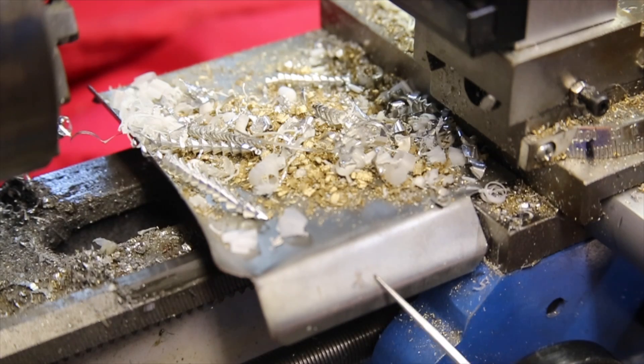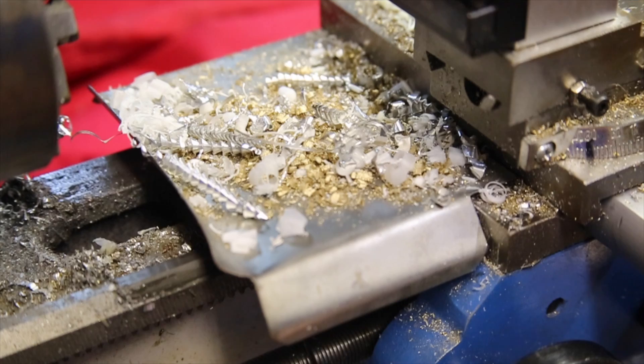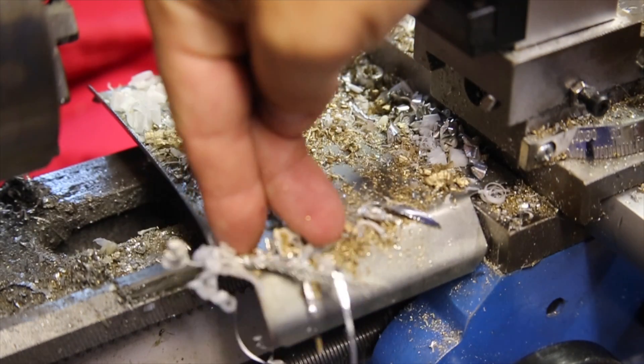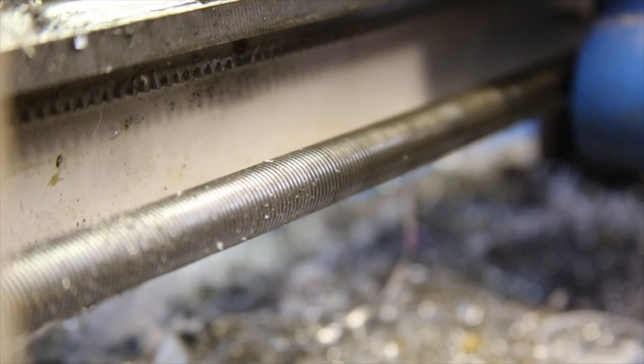There are also two downward bends — one on the front and one on the back. Notice how the front piece is overhanging the lead screw. These are to encourage the chips to fall into the chip tray below. I noticed very early that chips were going to get caught in the lead screw, and this extension does a very impressive job at keeping the screw nice and clean.